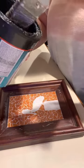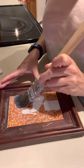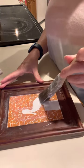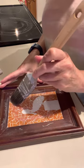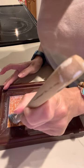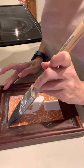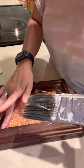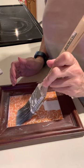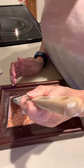Get a good bit on your brush. You don't want to leave a really thick coat because then it'll dry too thick and crackle into little pieces. You want good coverage all over but kind of thinned out. If you get a little bit on your frame, that's okay — we're gonna go back and wipe it off. Get it all the way to the edge so your grout won't flake.